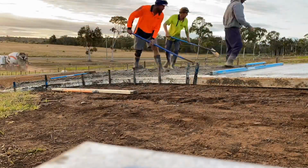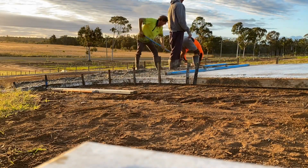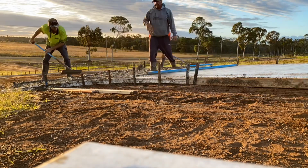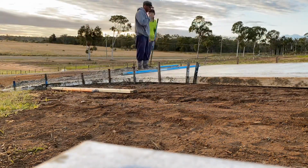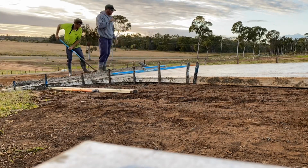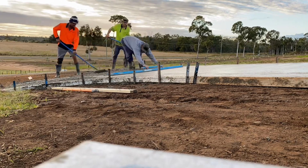Alright, I thought I'd put yours on time lapse so you can see nearly all of the driveway getting put in. Just remember when you're going down the hill to keep the concrete high behind you, because it's going to fall, and doing exposure, you don't want to tear it apart, because you'll have misses with no rocks in there.